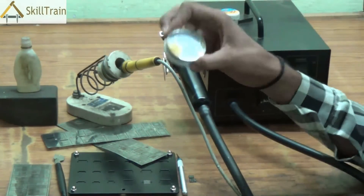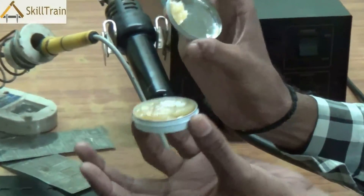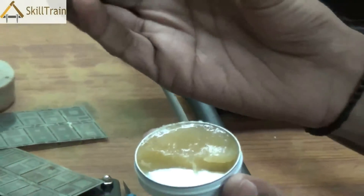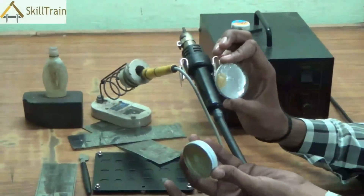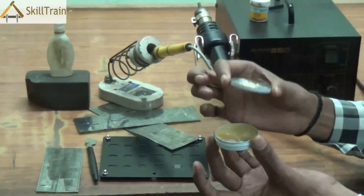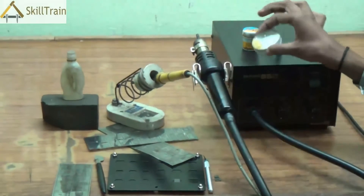Apart from these tools, we will also need a paste — but this is a different kind of paste. This is not what we use for soldering and it is not flux. This is called a reballing paste, which looks very different, and this is the paste we will need to use while doing reballing. We should not use the other types of paste such as flux, as they can create problems on the IC and in the entire reballing process. So you need to ensure that you use the right reballing paste. This is also available as part of the BGA kit, so when you buy a BGA kit you will always get reballing paste along with it.